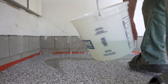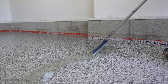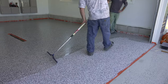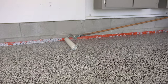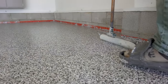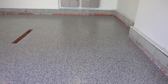We're going to take this flat flexible squeegee — it's important that we use the right tool here. If we use that same notch squeegee from before, it'll put the top coat on too thick. With the smooth squeegee, we use the chips in the floor as our gauge — we pull it as tight as we possibly can, almost scraping it off the high spots and letting it settle into the low areas. When we back roll it, it redistributes and gives us the perfect top coat. Work quickly, spread it, back roll one time, and then just let it do its thing. Messing with it too much will make it sticky and cause inconsistencies.